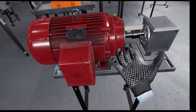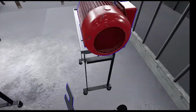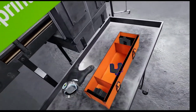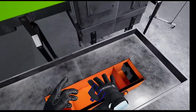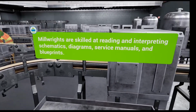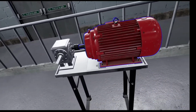You got them fast. That's an organized toolbox. Great work. Now you need to place shims of the same thickness under all of the feet of the machine. This will raise the motor the same amount as we measured using the straight edge. Do that now. Fantastic work. We want our rough alignments to be within 10 thou, typically.